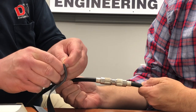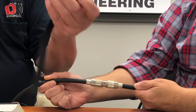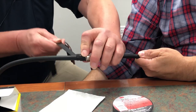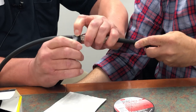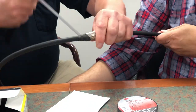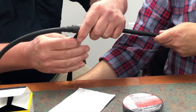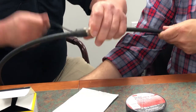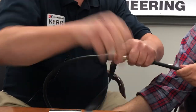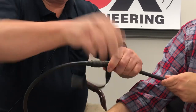This is a rubber-type tape that does not have any adhesive — it only sticks to itself. So we'll put this on here and pull and stretch from the very beginning. Pull and stretch — it makes a tighter form. Wrap it around the connector so that it almost turns gray, as opposed to black, when it's stretched enough to be sealed and stick to itself. If it's stretched too far it gets too light and won't do as much sealing. The idea is to put this self-amalgamating tape onto the connectors.